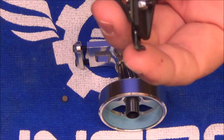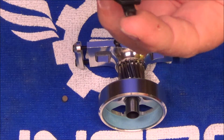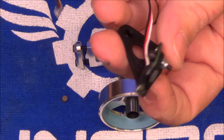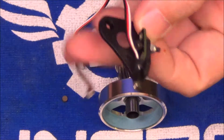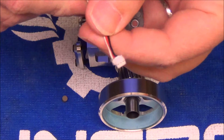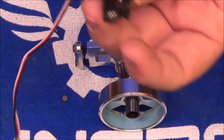I know guys run the Futaba magnetic RPM sensor — works great. I know a lot of guys run the Spektrum RPM sensors. If your flybarless unit likes backplate sensors and you prefer to go that route, by all means go right ahead, you just won't need this bracket. My ICON systems use this micro JST plug that comes standard on the Align RPM sensor, so I like to use the Align sensor.